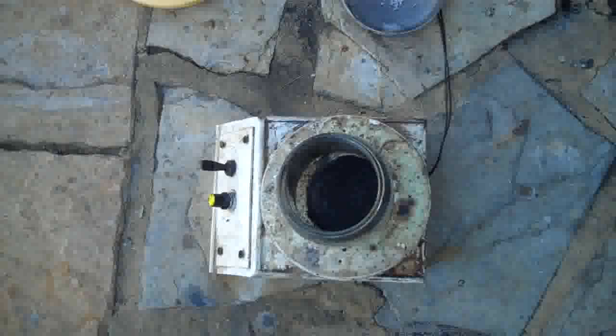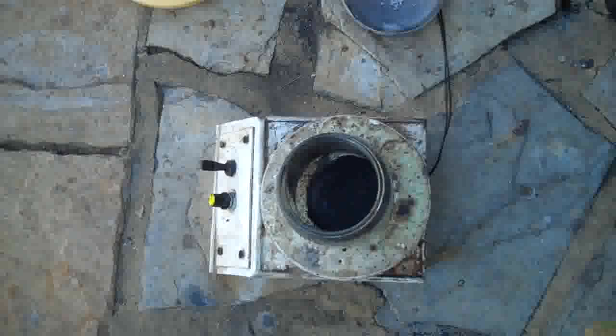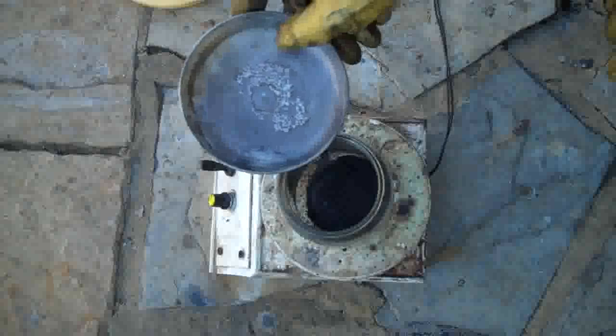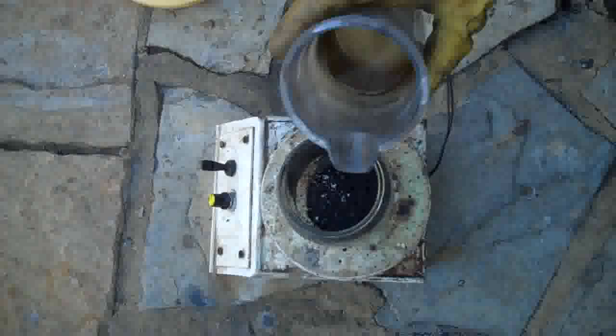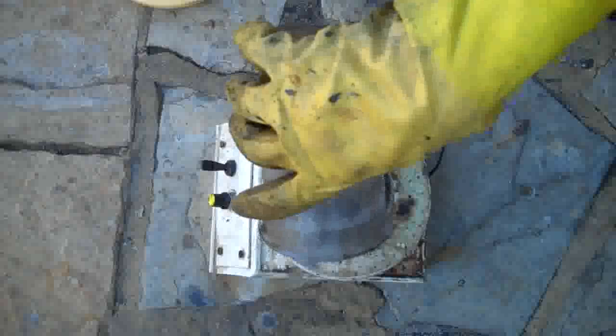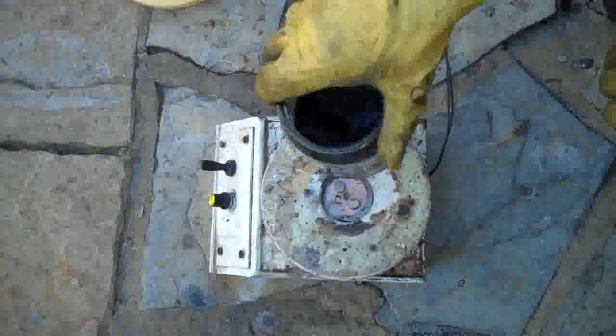In that jar we have five grams of graphite powder. Because I'm working with acids, you'll notice the thick yellow gloves. To that five grams of graphite powder we add two and a half grams of sodium nitrate — just chuck it in there. Then we add 115 millilitres of 98% concentrated sulfuric acid. At this stage all we're doing is mixing it for half an hour. It will heat up a little bit, just getting warm to the touch.